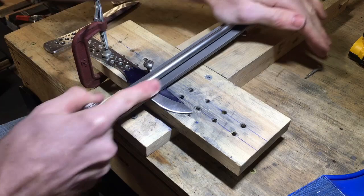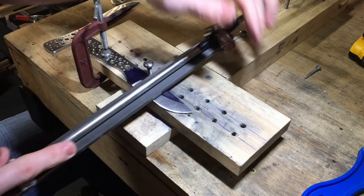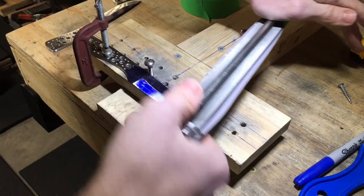If not, take out the file jig — you can build it for a very low cost, and I'll link a video on how to do so from another YouTuber. Take your file or a file covered with sandpaper and start working up to your scribed bevel line. This will allow you to get a bevel that is even and flat. You can roll the sandpaper over to the edge of your file and work into the plunge lines you created with the chainsaw file — do this gently and you should be able to clean them up nicely.